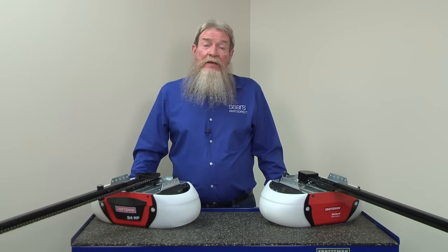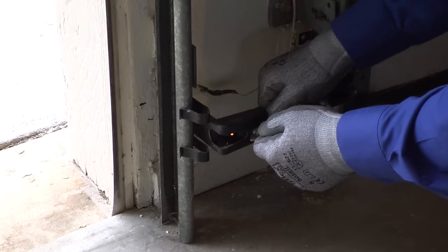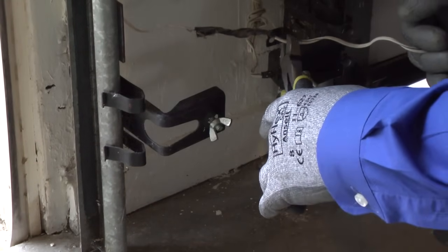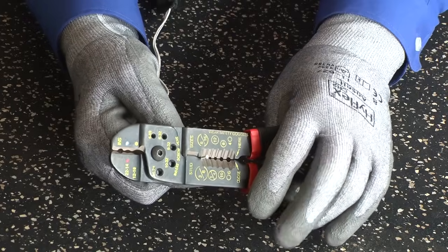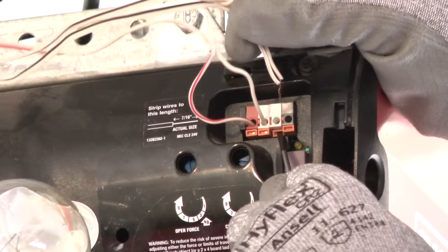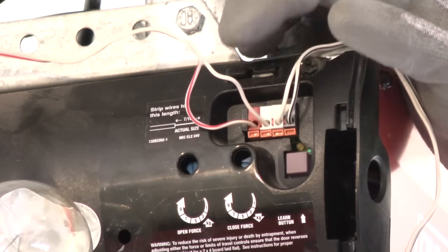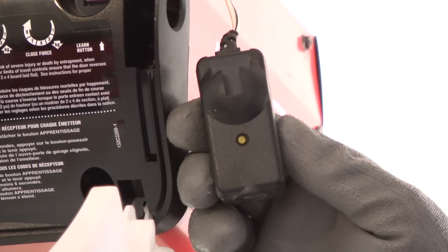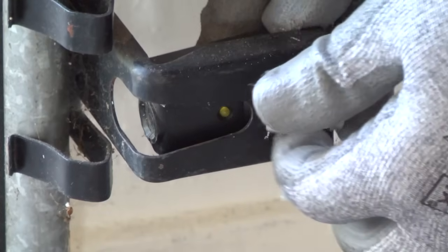If these tips didn't solve your problem, test your safety sensors directly at the motor unit. This test will help you determine whether you have defective sensors or a break in the wiring that's not visible. We'll check the sending sensor first. Remove the sending safety sensor with the yellow light from its door rail bracket. Disconnect or cut the sensor wire about one foot from the end. The sensor wire has two strands — separate the strands and strip one half inch of insulation from the end of each strand. Disconnect the existing safety sensor wires from the motor unit. Connect the short white wire strand to the white motor unit terminal and the other wire strand to the gray terminal. Check the yellow light on the sending safety sensor. If the yellow light doesn't turn on, you confirm that the safety sensors are defective. Here's a link to a video that will show you how to replace them.